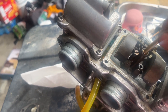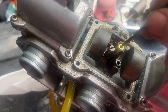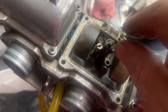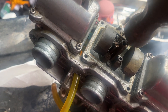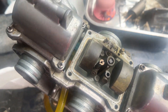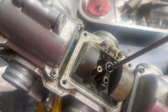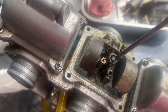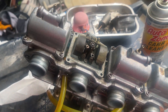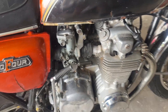A little trick since this is press fit: I drop it in here and it only goes to about right there before you have to start hammering it. But it's brass, so I put a little zip tie down there and then I can press fit it. Then I come back through with just a little tap to seat it — but I never touch metal on metal, it's always on the zip tie. That's the trick to help you not damage any brass piece going in.